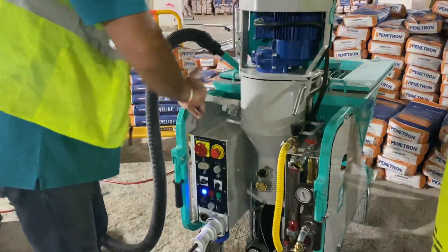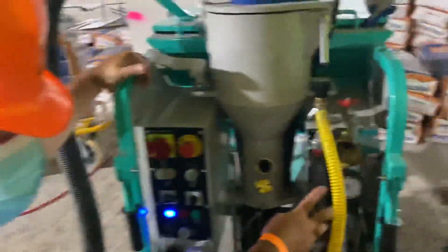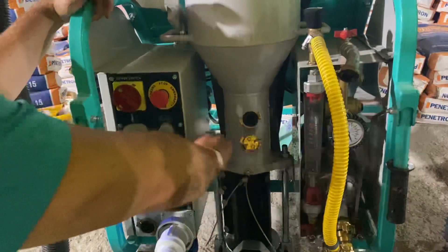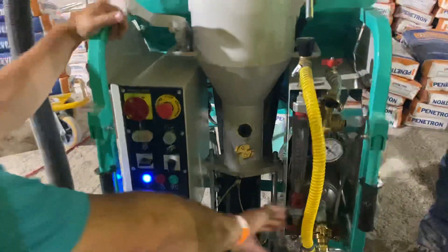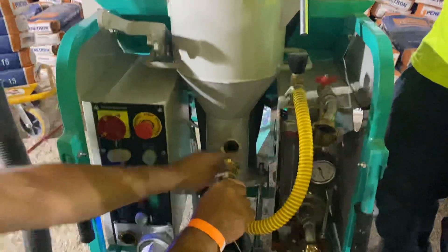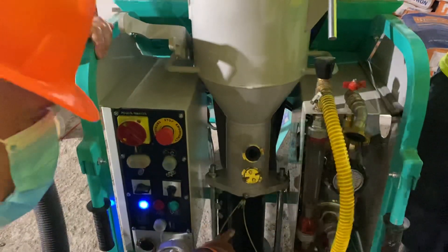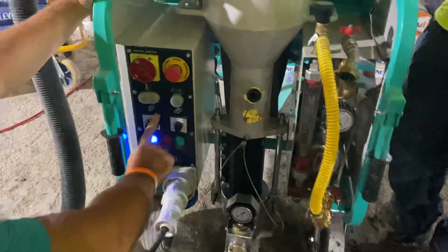Before you start, your drive drill is in there, your rotor/stator is free, you have all your water pressure, and your hose is hooked up. You're going to want to fill this chamber up until the water comes out of here — that primes everything for your first mix and also pushes the material through. Hold this button and push your water until it starts pouring out, then lock it in and you're ready to go.